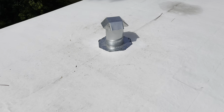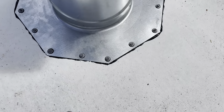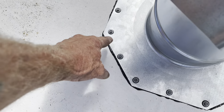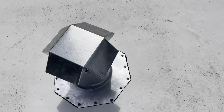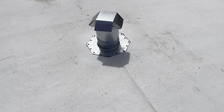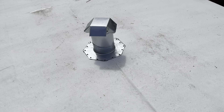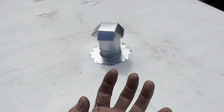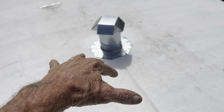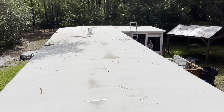And there you go. After you apply the sealant to the bottom side, if it's octagon, screw every point and then the centers. Very easy. Mobile home roof vent install — super easy. Cut the hole with a skill saw, clean it up around it, stuff your vent with screen so nothing can get in it, screw it down after you put the sealant on the bottom, and you're done. Anybody can do this.